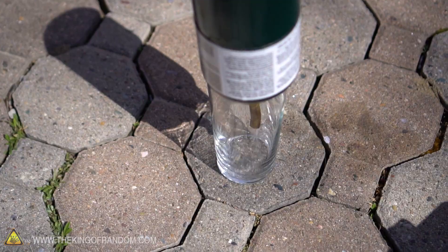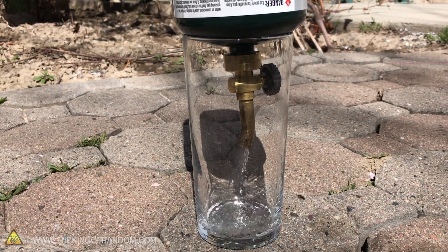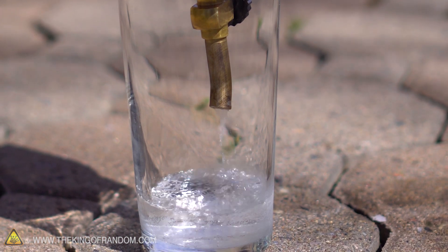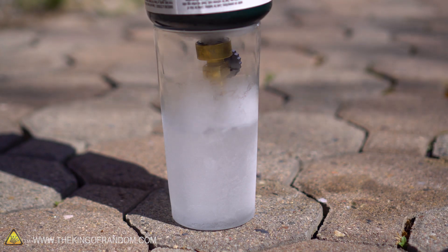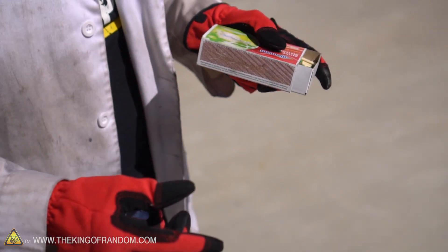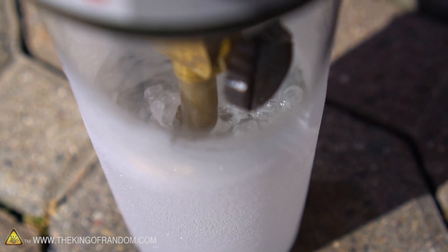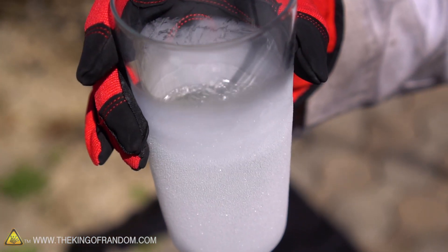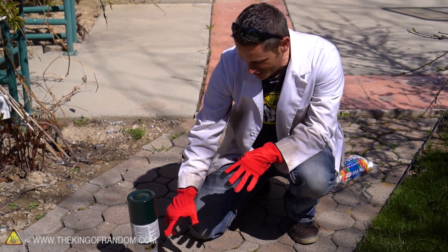It is working. Now that our glass is filling up with propane, let me tell you about some of the characteristics of propane. We already know propane is normally a gas, but if you compress it and put it in a pressurized steel container it carries as a liquid. The liquid is pretty cold — but not as cold as liquid nitrogen. Propane boils at minus 40 degrees Fahrenheit, about minus 42 degrees Celsius, but it won't freeze until minus 306°F. Even so, contact with bare skin can cause frostbite, and the bigger concern is it's flammable. Propane vapors are heavier than air, meaning they sink into corners rather than floating away — in a confined space this could push out oxygen and suffocate you. It's been about six or seven minutes and the glass is about halfway full; frost is forming on the outside. Our capture rate has decreased — most of the liquid is out and we're blowing bubbles — but the tank is still pumping out liquid propane.